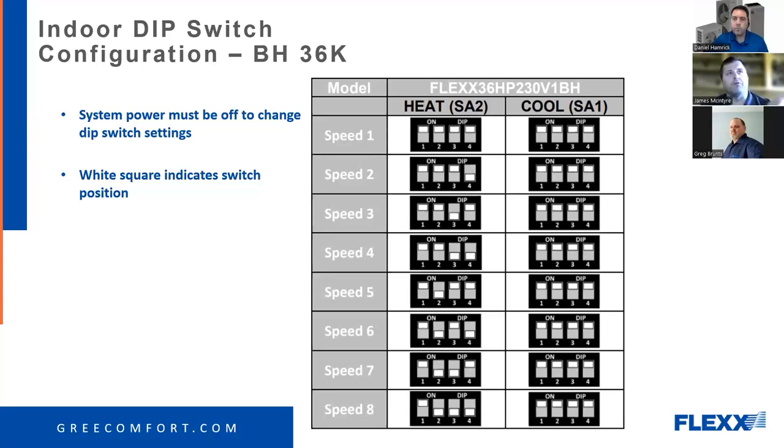In real life it's been about two minutes. I did some timing on a unit in South Dakota and two minutes seemed to be the longest run time. During the Texas freeze a couple years ago on the A model, it was around two minutes from valve switch to valve switch — so from when it stopped heating and the reversing valve switched, to when it switched back. In that amount of time, the coil doesn't get significantly colder, so defrost is very quick.